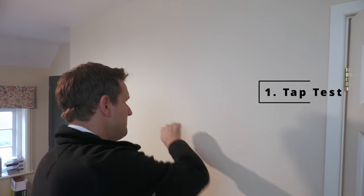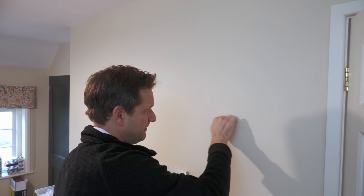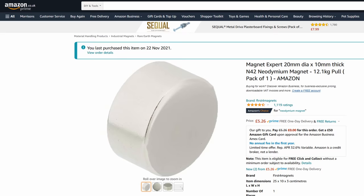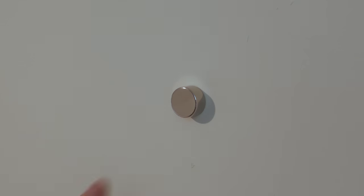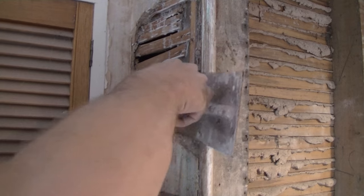Taking a line across the wall — that sounds quite solid, then that sounds hollow. I used this tap technique a lot in the old day job. But you can't always guarantee a stud where you get a solid tap, so you could combine this with one of these: a super strong magnet. Trailing the magnet across the wall, suddenly it finds some metal behind — either a screw or, in a more traditionally constructed wall, nails attaching the lath to the studs.